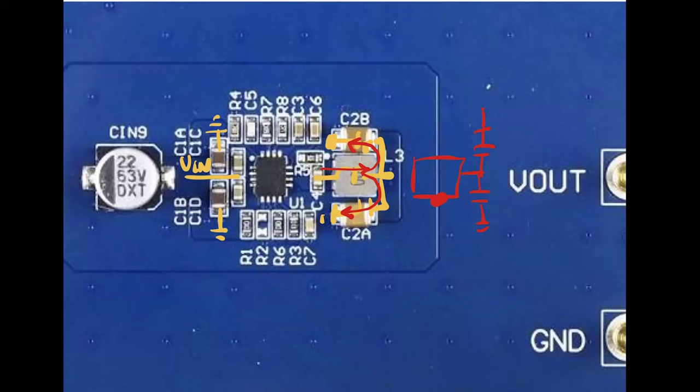Can I use one LISN box and do one conductor measurement at a time? Yes, you can. This is what you get when you buy a LISN with a switch. It's a switch in the front panel. So you switch from line to meter line or to meter neutral or to meter positive and to meter negative. The only disadvantage is that you will not be able to calculate differential mode and common mode. This is the only difference because they will not be synchronized, and depending on your instrument, perhaps you only have the spectrum and not the phase. So you will not be able to add or subtract.